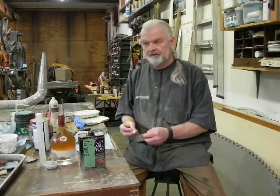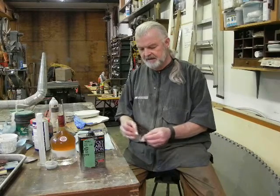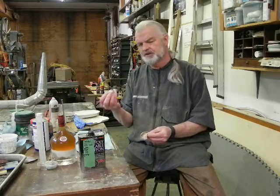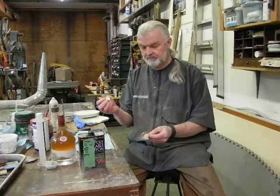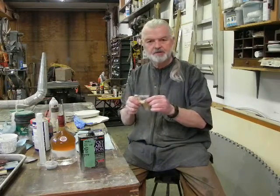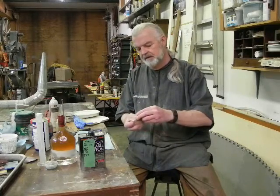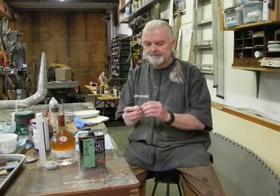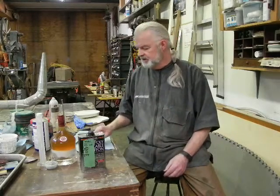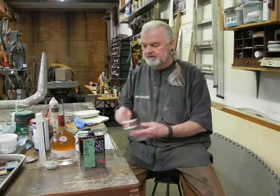So I don't know if you're familiar with French polish, where you make a pad out of a piece of material. This is a t-shirt or something. I've used even blue cloths, and you use a little bit of nylon stocking. And nylon stocking, of course, is good because it doesn't have lint. You make a little pad like that, and away you go. What I was doing initially was pouring some off and dipping it into the product.